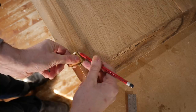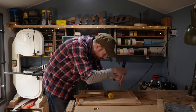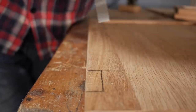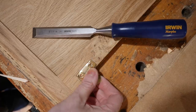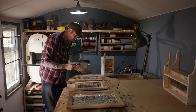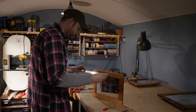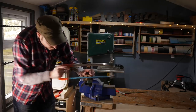I needed a way to attach this to the wall and what better way to hang it up than to use some mirror plates. I mark around them and then use a chisel to cut out the waste like if you're fitting a hinge. Before I get any hardware installed I'm going to get some finish on — and I don't even need to tell you what I'm going to use. These were some really scrappy pieces, some with quite a lot of spalting in, but with the oil on they really look nice. I think I'd definitely use this joinery method again if I ever need to make some cabinet doors. So the mirrors need to be hinged, so I've got some brass piano hinges that I'm just going to mark out how long I need them to be and then use a hacksaw to cut them to length.